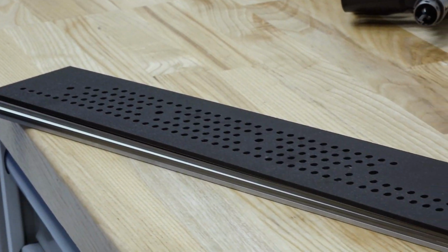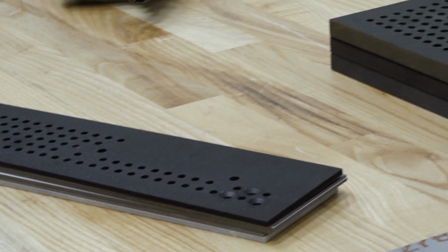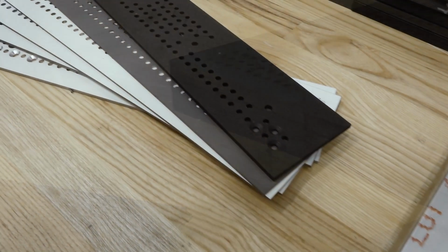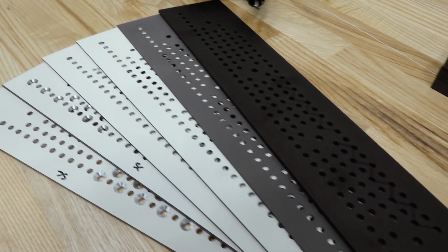Well, and then the additional challenge is that with the drill motors that they were using, their ADUs were pneumatic, so you have a fixed feed and speed. So now, instead of transitioning with feeds and speeds through the different materials, you have to choose a fixed feed and speed to accomplish your goals. With a single tool? With a single tool. Through all that material? Yep. And different materials? Correct. And no burrs? Right. Sounds fun. Yeah, it's fun.